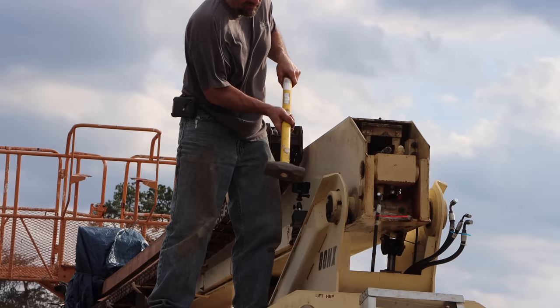Alright, so here's the deal. I lifted it up to the right height with the car lift, obviously, but I propped some things under there just in case anything jumps when I'm pressing this thing out. I don't want it to unexpectedly fall. And obviously this end is supported by the press itself. So now it's got the press, both sides of the car lift, and then a bunch of blocks over there. So that's not going anywhere.